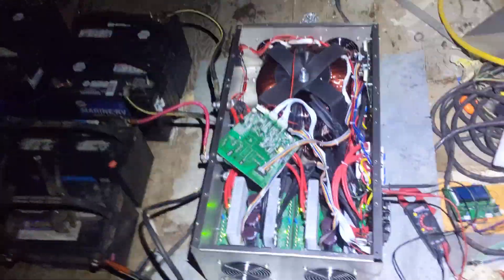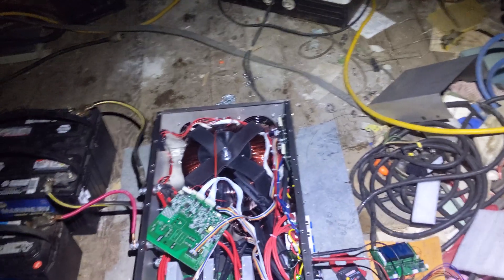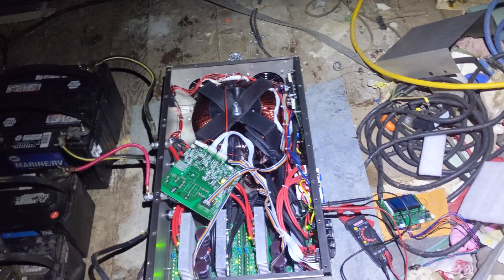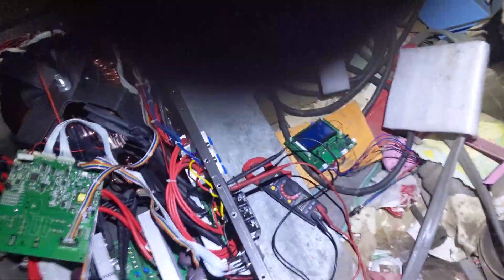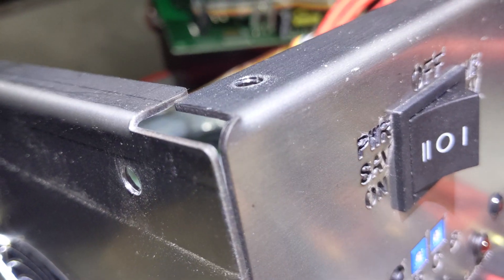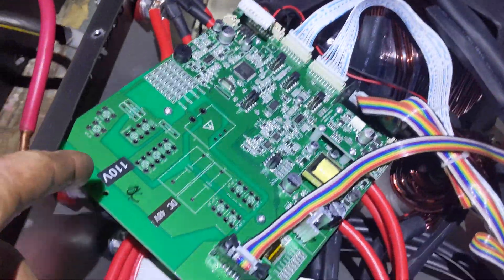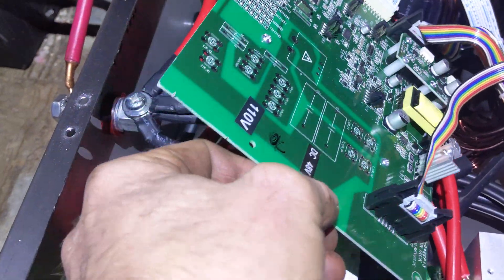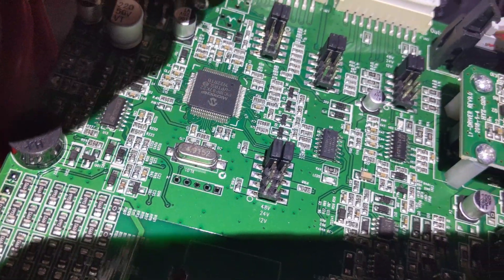I'm here with the inverter and I tried powering it up. I decided to just go with it and not inspect anything inside first — I thought maybe it'd be fine, but obviously it wasn't. When I turn it on, it just faults to an alarm like that. So I popped the cover off and this is what I see — this board is just laying here on top of these terminals, and it obviously shorted out on them, and this connector is disconnected from it.